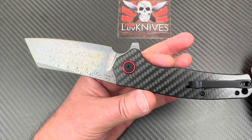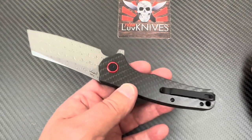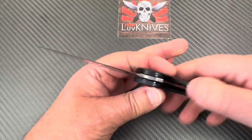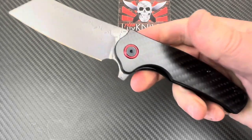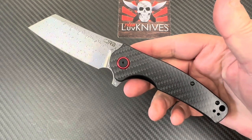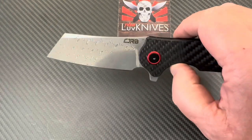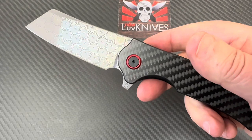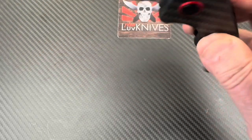It is a full stainless because it is a powdered metallurgy form of 9CR18. So instead of a 12-chromium steel it's an 18-chromium steel, and it's powder metallurgy instead of just standard D2. This blade is probably 9CR18 type steel done in Damascus — I don't think this is a D2 Damascus.